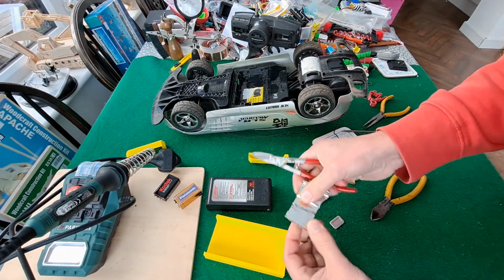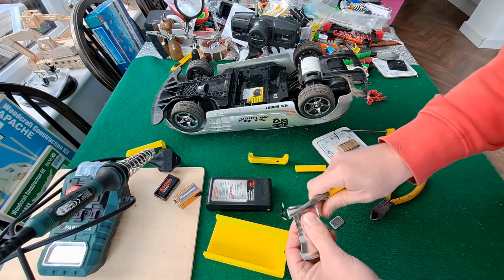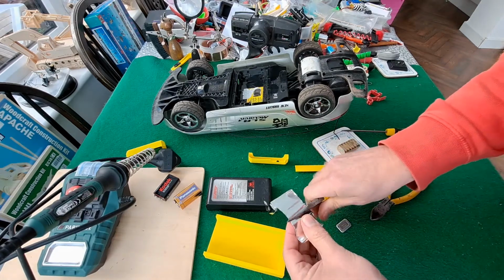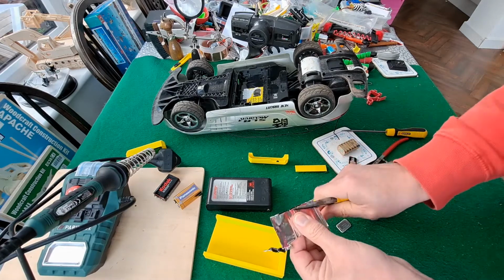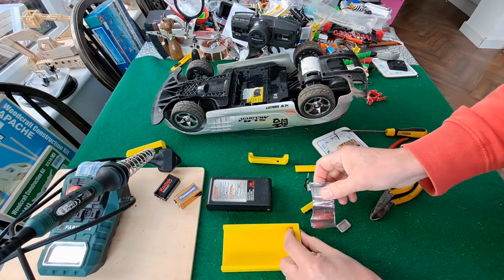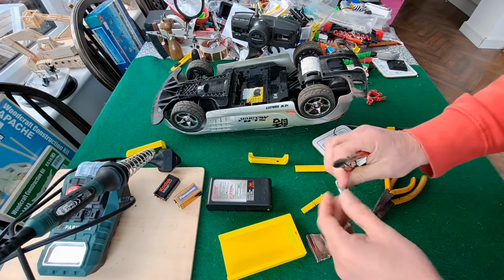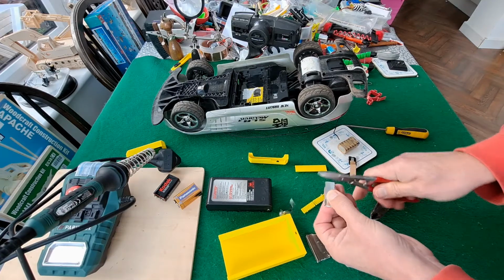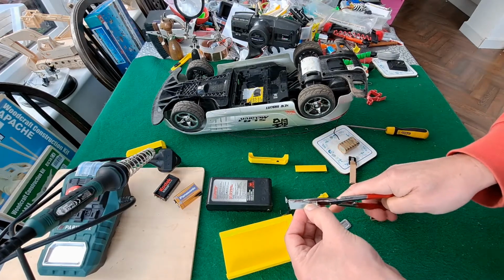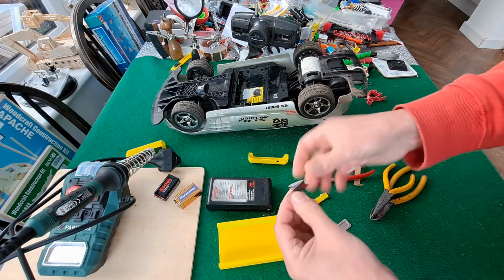Now before I go too much further, I will just check that that metal takes solder. Otherwise I'll be spending a lot of time getting it all nicely folded, and it would have been a waste of time because I can't solder the wire onto it. Although I could clamp it on, I suppose, fold it over and flatten it. We need this to be about 1 centimetre wide. Let's start off with a piece that we can practice on. Right, that's a little bit more than a centimetre wide. I could measure it, or I could just keep trimming it till I get it right.